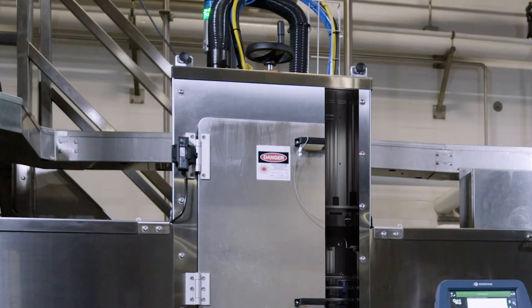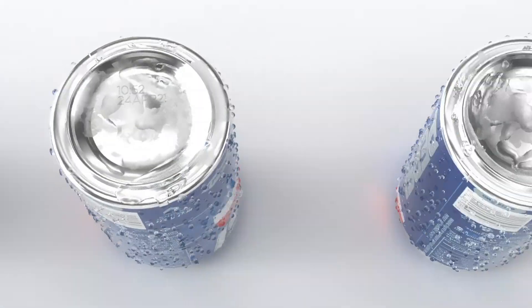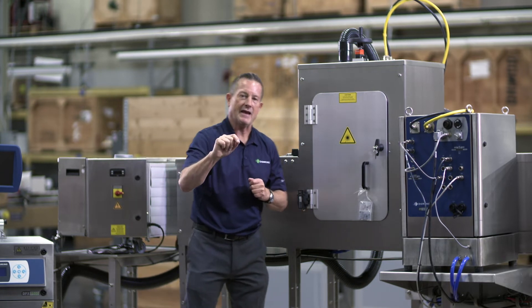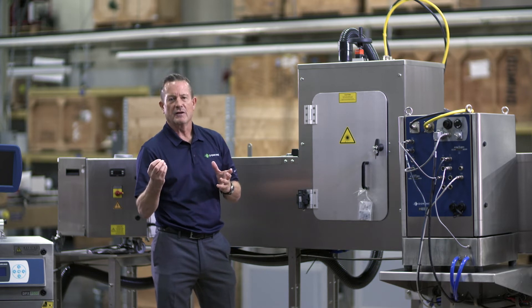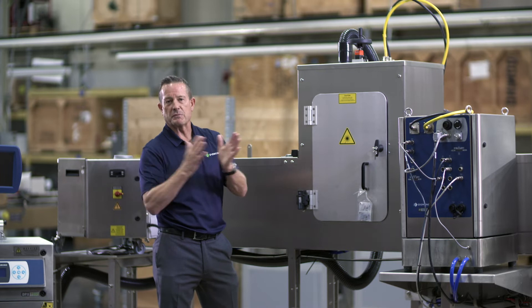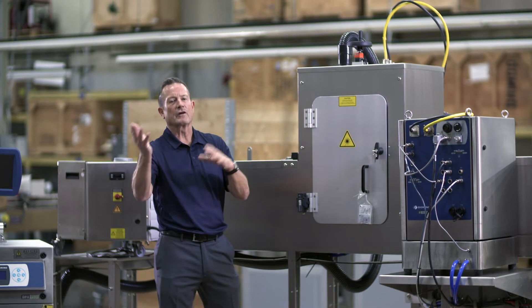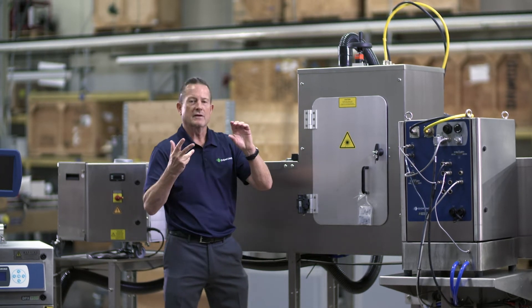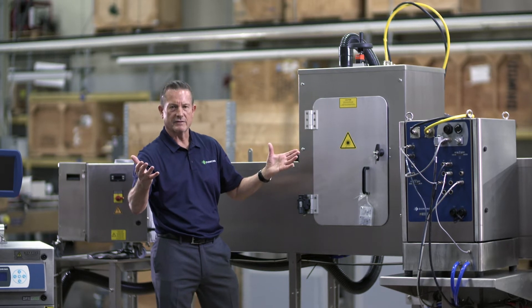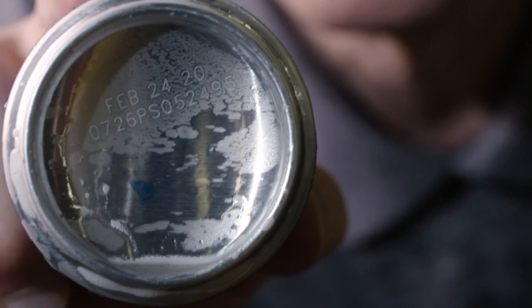Let's talk about the laser itself. As you'll see, it's small and it's powerful. It runs at over 2,000 cans per minute and produces over three millimeter tall characters. With all that power, it still does not compromise the integrity of the can — we're only taking off 5 to 7 microns of material. From a mean time to failure perspective, the laser has a life expectancy of about 100,000 hours. If you do the math, that's a little over 11 years running 24 hours a day, 7 days a week, 365 days a year — effectively over 15 years in real-world use. It's IP65, built for a wet, hot environment.